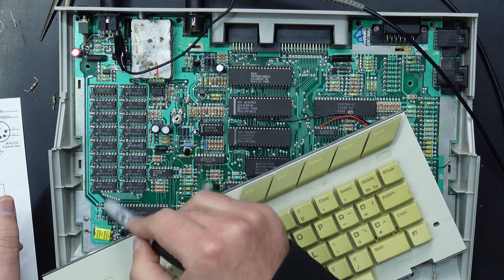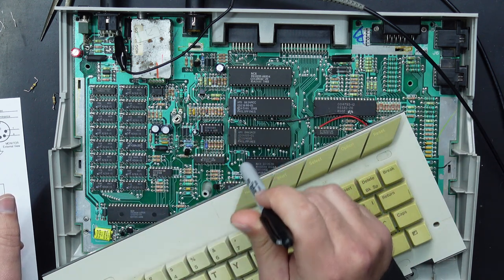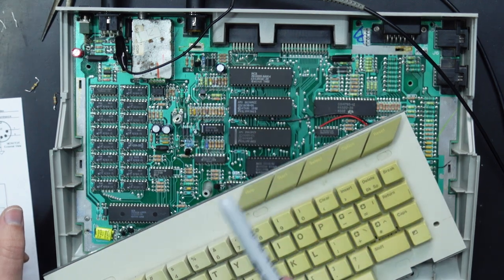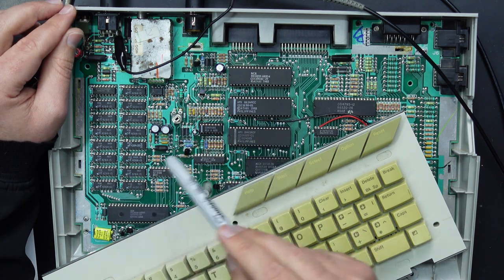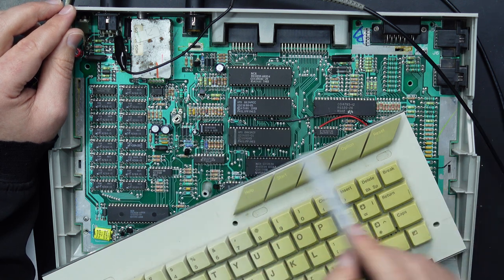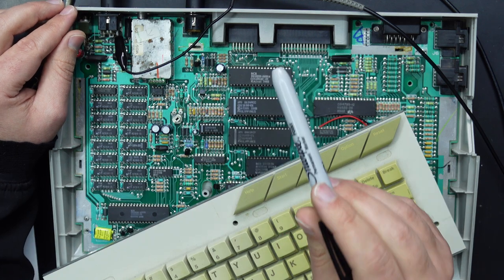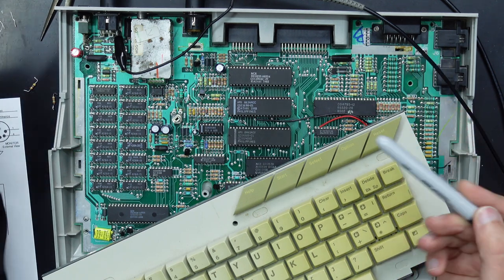It's to sort of try and mitigate some of that noise and keep the signal nice and clean. If we imagine looking at our scope again, that the ground signal is noisy, then every time the ground signal goes up, that counts as an offset towards what the rest of the Luma and sync signal looks like to the display. Now imagine that noise happens at the same time every scan line. When that gets sent to the display, what you're going to get is an effect where it'll look like there's lines down the screen, like our jail bars.